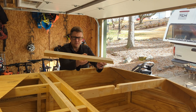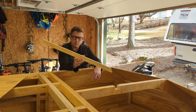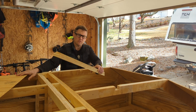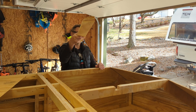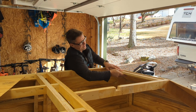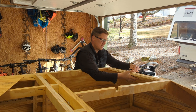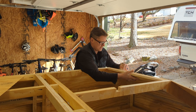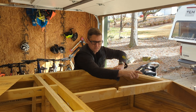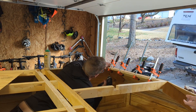Here's the part we were building — it's one of the last pieces of the nose before we install the roof over here. It's going to fit right underneath as shown in the diagram, and then we're going to glue it, staple the front skin to it, and drive in some two-and-a-half inch screws on the side with glue, which is going to make for a very strong nose.